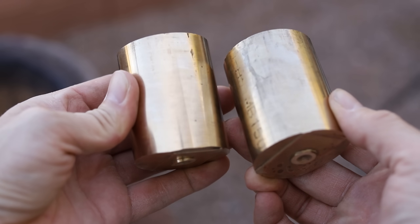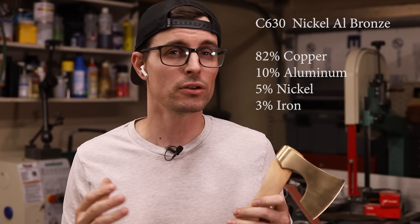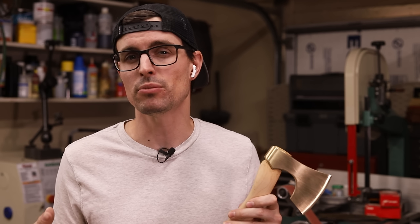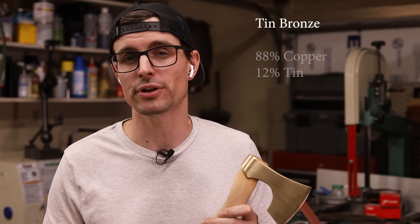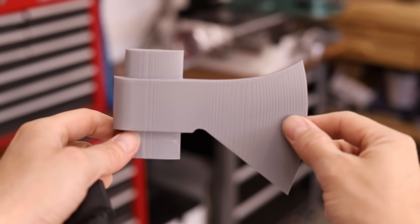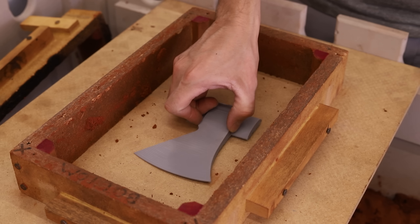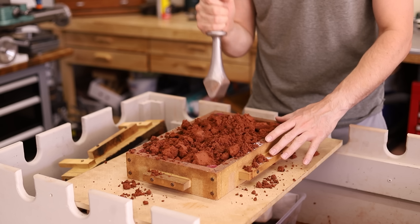It has all sorts of different metals added to it to make it extremely strong. So in today's video I'll be making two hatchets — one using that real aluminum bronze and another one using tin bronze, something that was available to people during the bronze age. I'll make those two hatchets and test them out to see how well they stack up against each other. I redesigned the shape a little bit to go for a more classic and practical design, and I'll be sand casting these using Petrobond, just like I did on the last one.